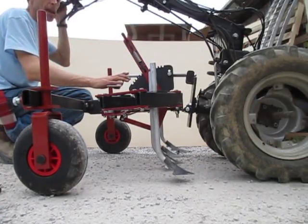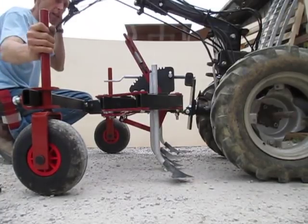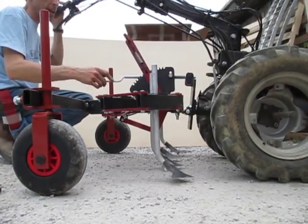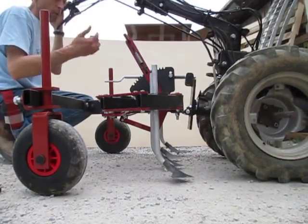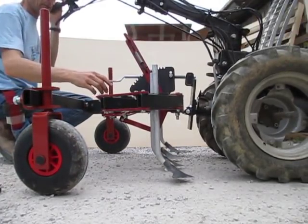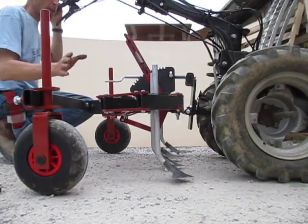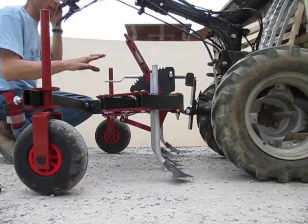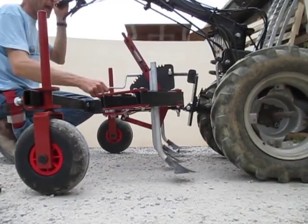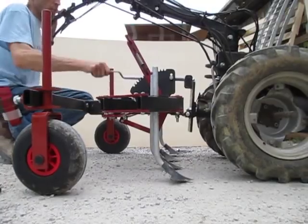This angle adjustment is also a handy way to jack the sweeps up out of the ground for transport. For example, if you've got your depth set with your gauge wheels and shanks at the right depth — say half an inch deep — and you're done cultivating and want to go back to the barn, you don't want to hold this thing up or readjust your gauge wheels and shanks. By cranking this angle back, it cranks those sweeps up off the ground about an inch. And if you crank it all the way down, it brings them right down to the ground.